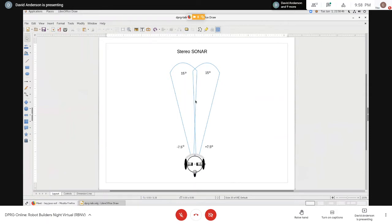That angle there, when you get a detection normally inside, you don't know where it is. You only know it's somewhere along in here. But with an edge detector, you know exactly where it is. It's directly in front of the robot. So you actually have a good XY location for whatever it is you detect by using these two edges as an edge detector. So that's how SR04 finds the soda cans.